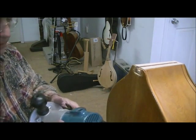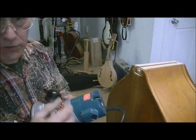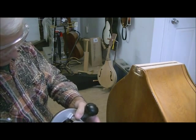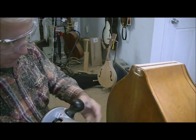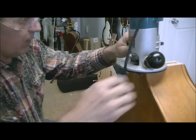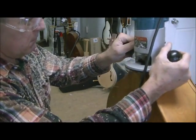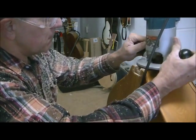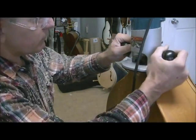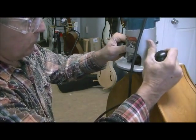What I learned — and I knew this already but got ahead of myself — is that the cutting length on the dovetail bit is not very long. So it has to go in very shallow increments. I need to come back up and actually widen the hole out some at the height where I was already cutting. As long as the bit is cutting wood all the way through, it doesn't really matter, so I've got the bit back up and I'm going to widen the area out a little bit.